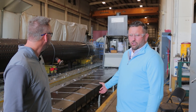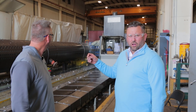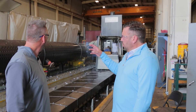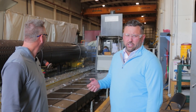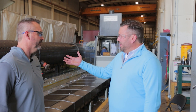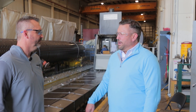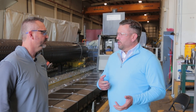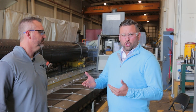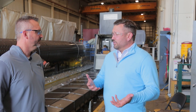This is about a 50-foot long steam drum. The idea behind this is that off of a simple AutoCAD drawing, we can locate the holes on a specific axis and drill all these holes very quickly. A drum like this normally would have taken 30 days to drill, and we're going to do it in about one shift. The accuracy of the holes really improves the tube-to-drum mechanical joint for the customer, and we're able to pass hydro tests on the first time and provide just an honestly better pressure vessel.